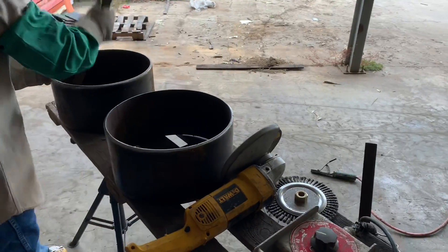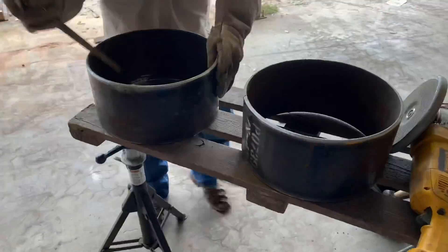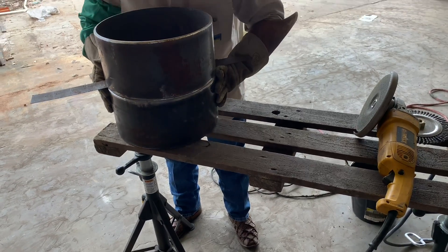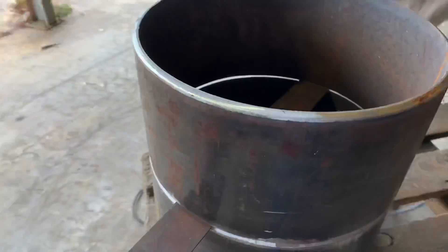About a nickel landing and about a 16th gap. You see him filing off the shavings on the inside after he put his landing on there. There's a spacing tool. So what he's going to do here, he's going to put two tacks in — about an inch long — one at 12 o'clock and one at 6 o'clock.